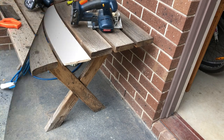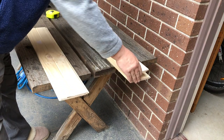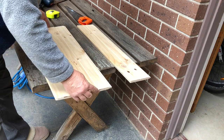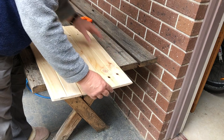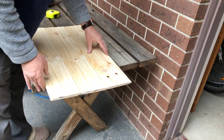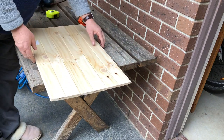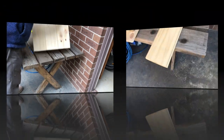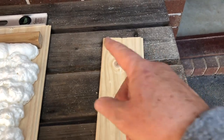So I'll just do that a few more times. There we go — we've cut three out of that one board, and two tongue and groove boards. You've got the tongue here and the groove — they just slip together like that. We'll glue them when we do the final assembly. It's short — it's only 40 across, I need 60, so I need to go and get another board. I just grabbed one to see how it was going to work.